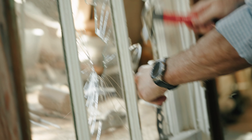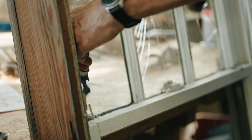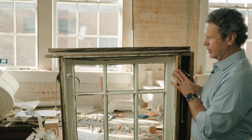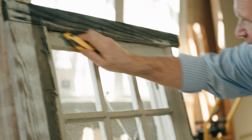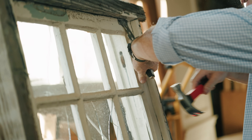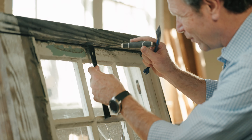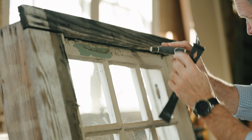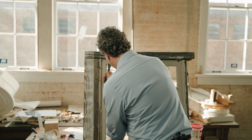Same thing at the top — I can feel it already breaking loose. Now I just have to break it at the check rail, which is right here. I drive my five-way down in there, just breaking paint lines, and I can see it's already moving. Now you have to go to the outside. I can spin this window around and do the same thing on the outside. Because this isn't weighted, I'm going to cut this line on all sides. I can feel the window moving. I'll take my five-way and my hammer and make sure everything is loose. I've got it loose — the only place it isn't loose is that check rail. So I take a pry bar, put it up in here, and just force this down — and there it goes. I just felt it move.